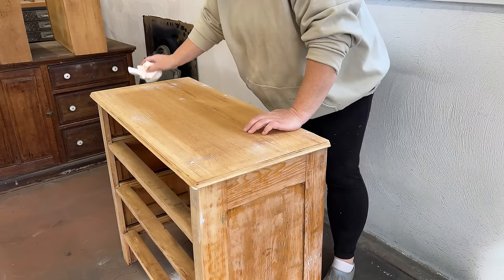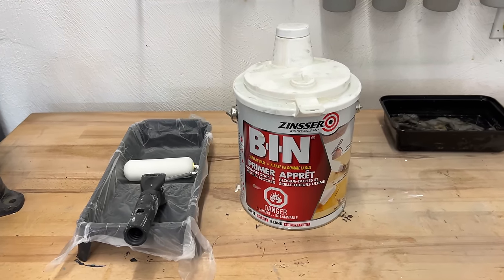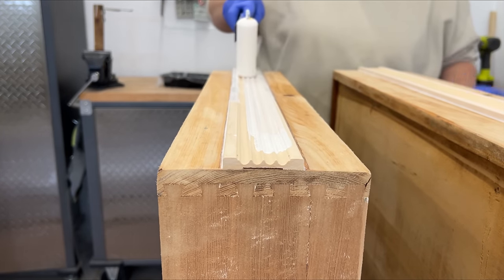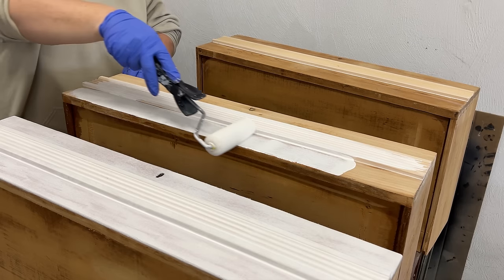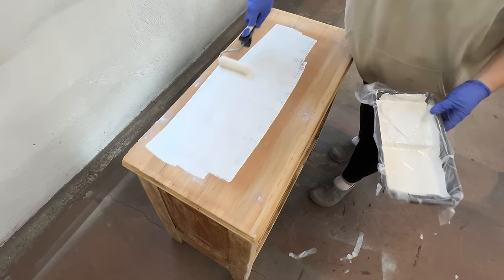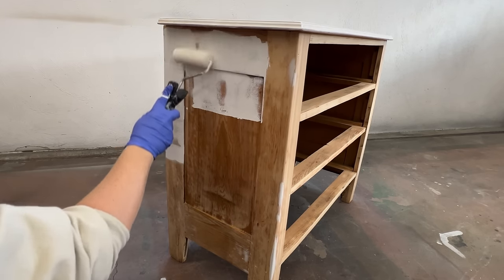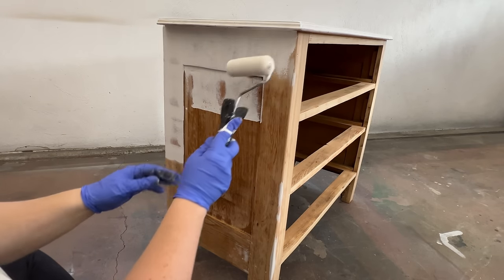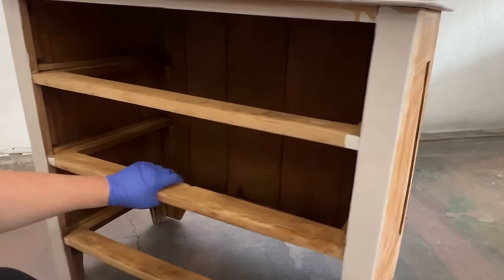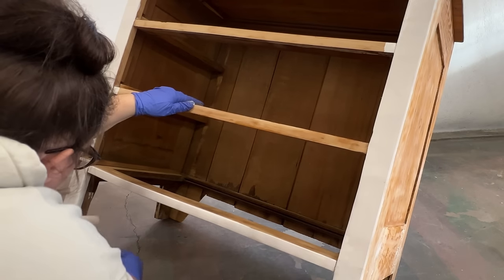With all the major sanding done, I wiped off any remaining dust with a microfiber cloth and then busted out my primer. This shellac-based primer is going to serve a few purposes: it's going to create a nice barrier between the wood and my new paint so that none of the natural tannins or oils in the wood can leach up over time and stain my new paint. It's also going to seal up the super porous exposed wood and create a nice consistent base for my paint to sit on, instead of getting absorbed, so I can use less paint and it'll have a more consistent appearance. I like to apply it with a roller instead of trying to clean it out of my sprayer, and I also like to line my roller tray with some foil or plastic wrap for easy cleanup.